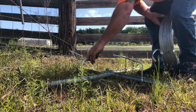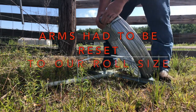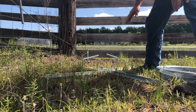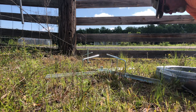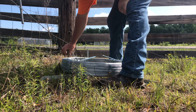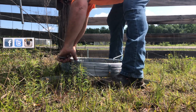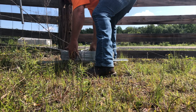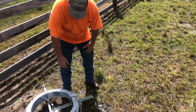We'll turn all the arms in. We had to adjust our arms — we had to bring them in a notch for the size wire spool we have, which is 12 and a half gauge high tensile. All we had to do is lay the wire over, turn these back out, set this on top of the stake, tighten everything down, and cut the bands. We got all bands cut and let's see how it rolls out.